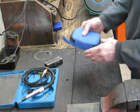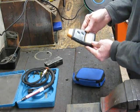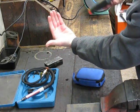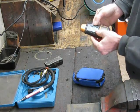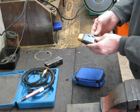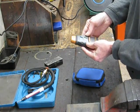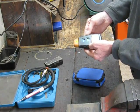These days you can get these things which are cheaply available — handheld laser digital tachometers. These have a numerical display and put a laser beam out, measuring the reflected pulse of the laser beam to get a speed reading. They do a bit of averaging and give you a speed reading. These are very good and also very safe — you can take a reading from several feet away and the accuracy is good.